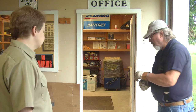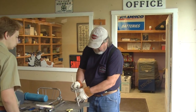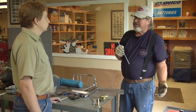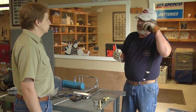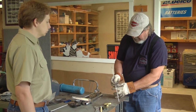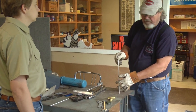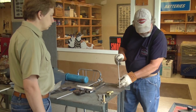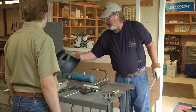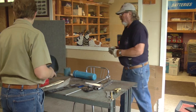This is called a fast freeze electrode. It welds real good out of position and it's deep digging. I use this electrode for almost everything because I can weld over paint with it, I can weld over rust with it. But if you're a novice just starting out, you might want to go to a 6013 — that's real easy to start. Electrodes have different diameters. This is an eighth-inch diameter. On an eighth-inch electrode, you're going to run it around 90 amps. Any time you weld, how you start an arc is you always scratch it a little bit like this.